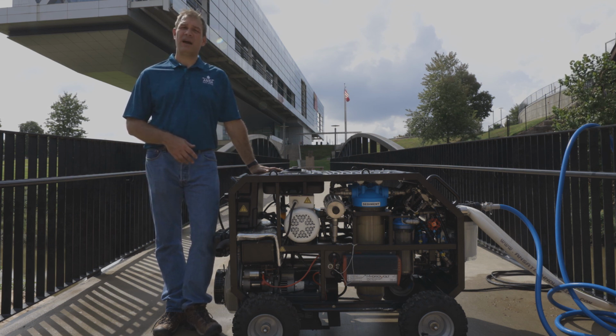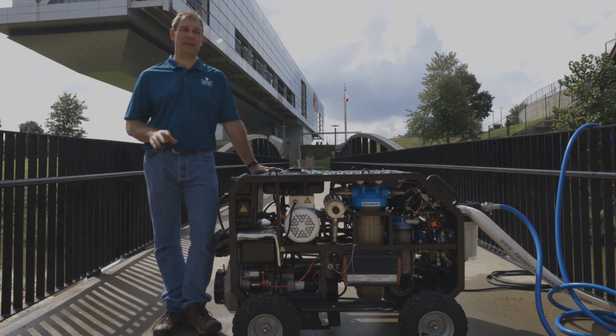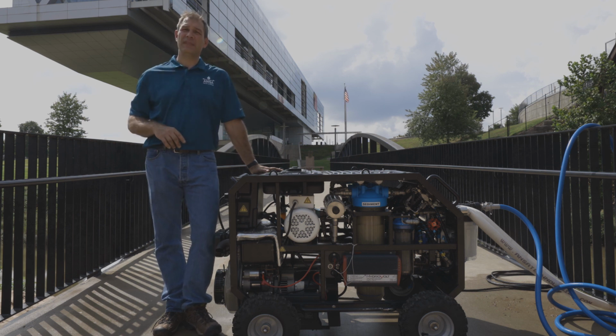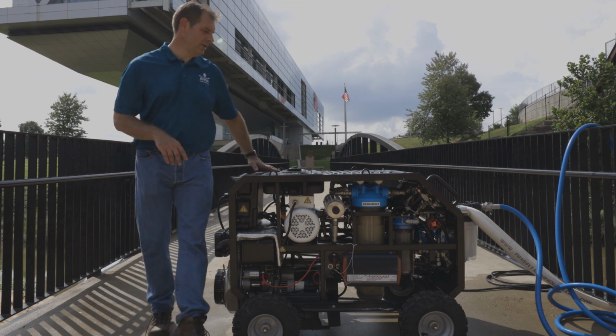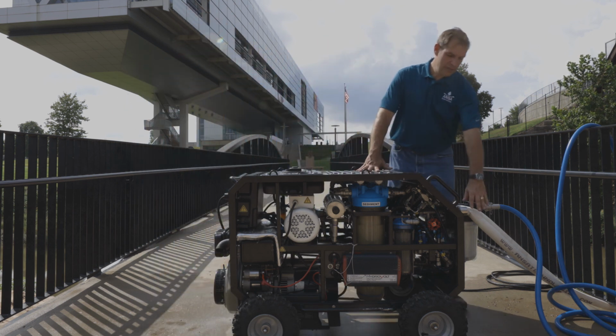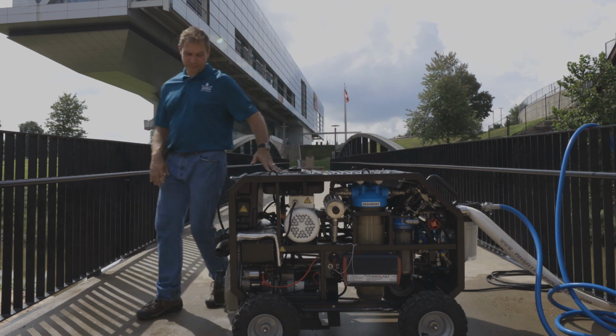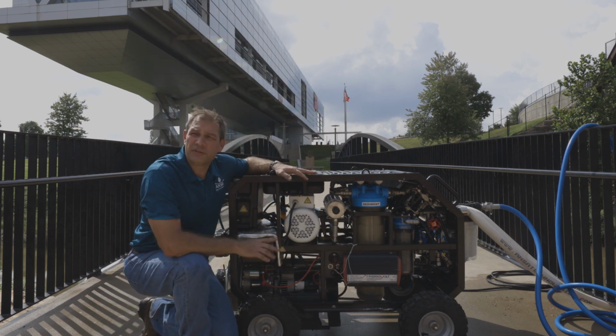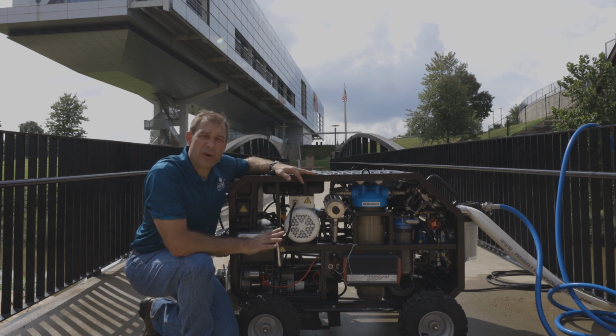It operates on a 7-stage filtration system, which starts with the intake pump, which you can't see. But if you'll trust me, go a little bit of faith, that is in the middle of this offshoot of the river here. Then that's our water source. So that is the first stage of the filtration, is the intake pump. It then comes into the unit here and goes into this filter right here, which is a disc filter. And that starts separating out the larger particles that are in the water.